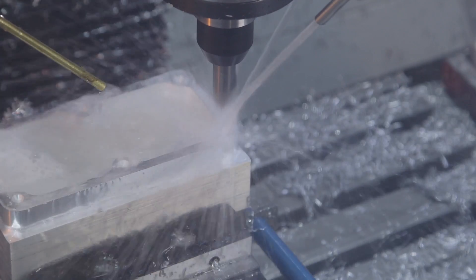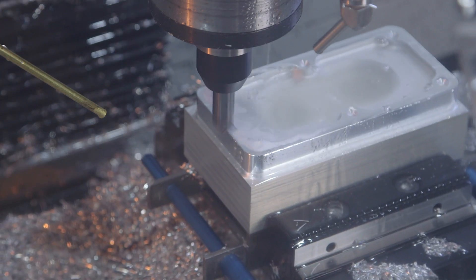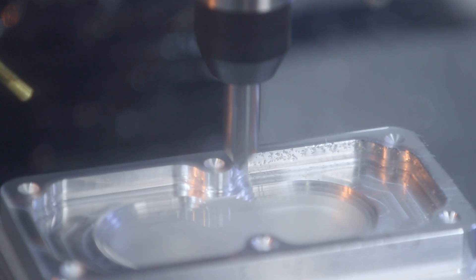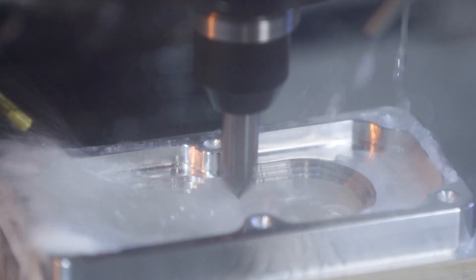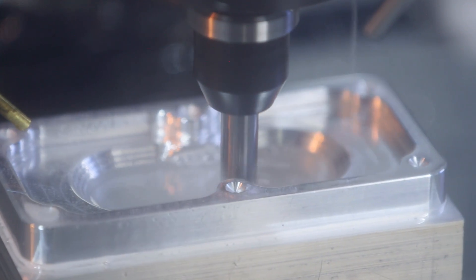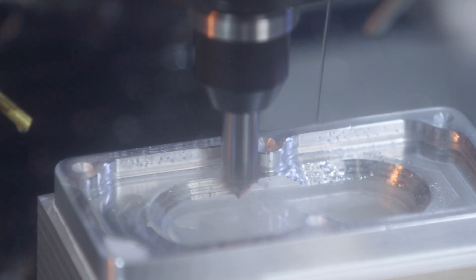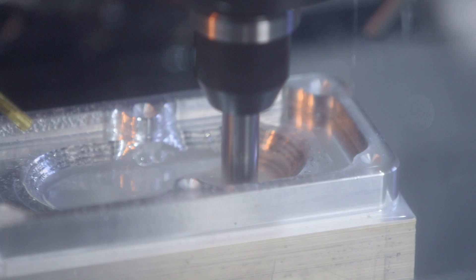So now we're on T4, the half-inch chamfer. We are going on the outside, giving us a 10 thou chamfer. You can see we actually have big amounts of stock to leave on the inside of one of our pockets — now we're going to come in there and do 20 thou passes to get a beautiful chamfer. This chamfer is actually half the size of my diameter, meaning I had to bring my tip just to the bottom to make sure it came out perfect.